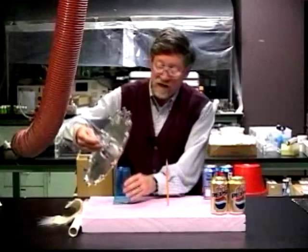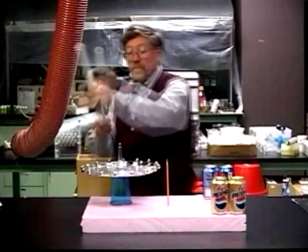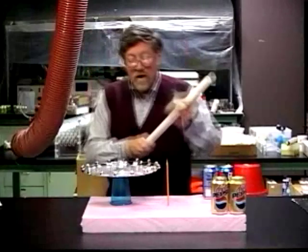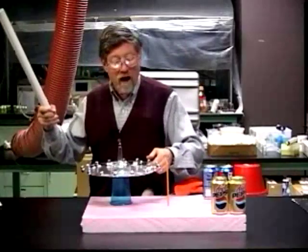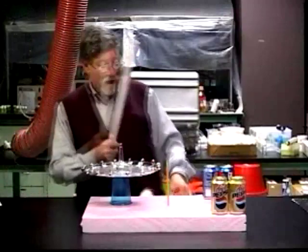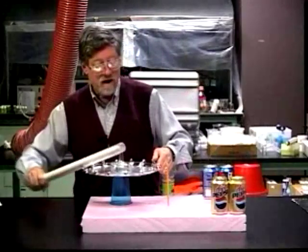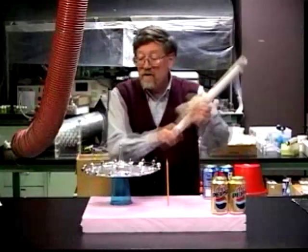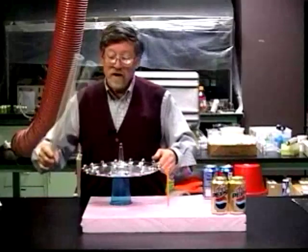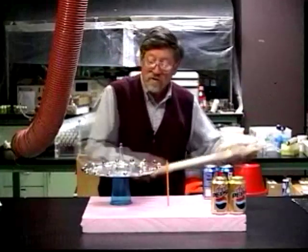This can be charged by setting it on top of an insulator. We can charge it by the tube in the following way: I touch one of the bells connected to the bottom while bringing the tube near one of the bells connected to the top foil, and I repeat that process many times. Alternatively, I could use the electrostatic generator to charge it, connecting the prime conductor to the top and the collector to the bottom.